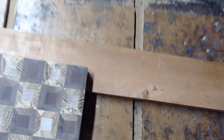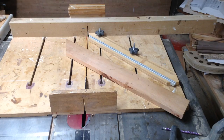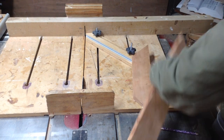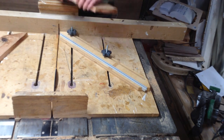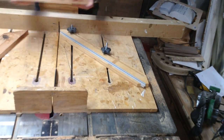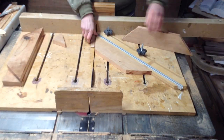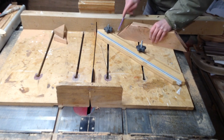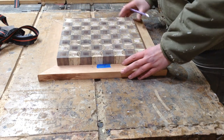I started by just cutting 45s on two pieces of cherry, putting the board basically where I wanted it, and then making measurements off the edge with little tick marks. Then I put 45s on those and those were going to be my two sides. The board is not exactly the same measurement on both sides — it's off by about an eighth of an inch — so the two sides were exactly matched to each side. The only problem with using the miter gauge on my cross-cut sled, even though it gives a really nice mitered cut, is that you can't do it with long pieces, so I just took my saw and trimmed them down to size and then cleaned up the miters on the cross-cut sled. I have a 60-tooth blade in my table saw and it leaves very smooth edges. Once I had the first two I could measure them off my originals and trim those down, and then I had my four sides — cherry leftover from a coffee table I'd made over the summer, already planed and jointed.